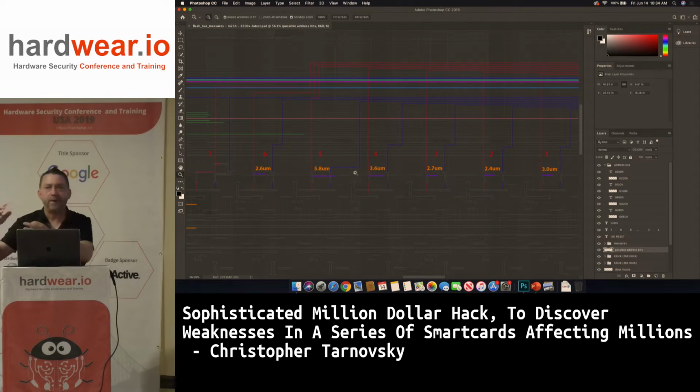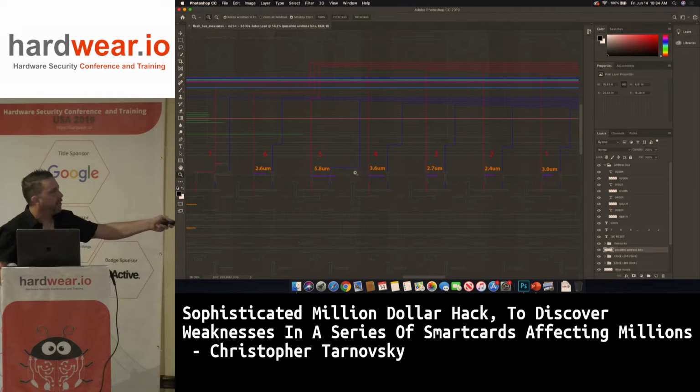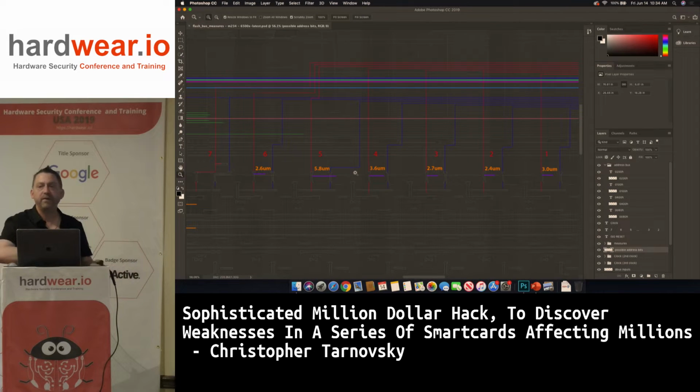So I've already strapped the boot ROM. So the boot ROM's basically not doing any of its self-checks anymore. And then I've cut the flash over here somewhere. I literally just severed the lines. So the wires are cut, and now the bus is floating. So the bus is seeing FF from the flash. And meanwhile, here on the left side, I'm seeing the data. You follow? Okay.